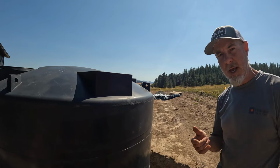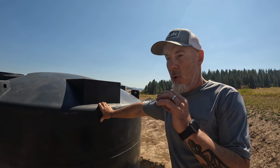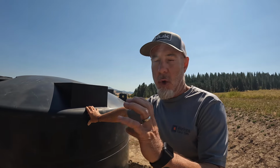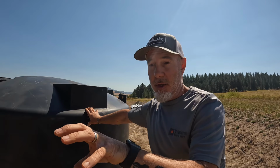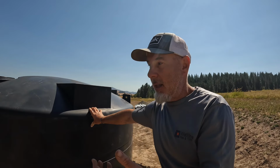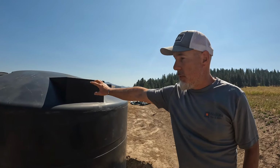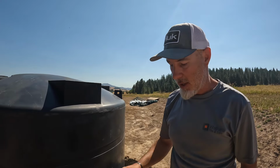The hard part is that this hole is gonna be on top of a 2-inch hole that's already there. So a hole saw has a pilot drill bit, and that pilot drill bit kind of holds that outer larger drill bit square to the thing you're drilling, and it doesn't allow it to move or anything. So that pilot drill bit is really important. This one will start drilling the pilot drill bit, and it will hold that big bit perfectly in position, but where there's already a hole there is going to be complicated.